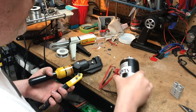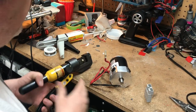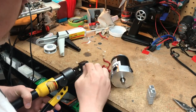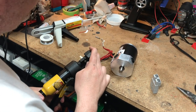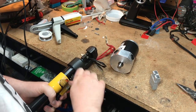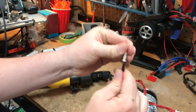Now that Ben's finished the motor, I can go ahead and put on our Anderson connector. The first thing we do is load one of the prongs into the hydraulic tool. We stick this in and then close it. This comes down a couple hundred pounds of force, then you release. And you can see we've crimped that — so this is now together.